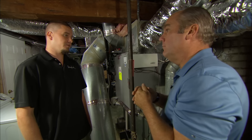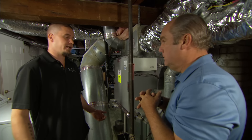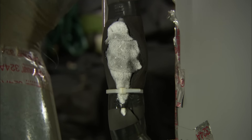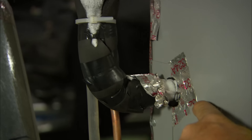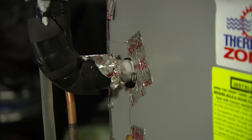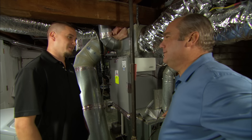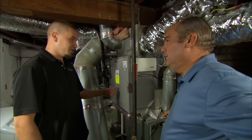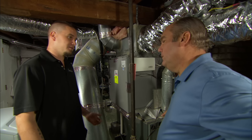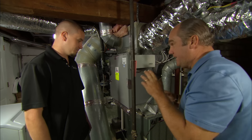What's going on with yours? Well, during the summertime I turn it on and the system runs for about an hour and then it stops working. So I come down here to check it out, and I notice that this is all frozen up. That's actually starting to form ice right now — on the line sets that go outside, and I imagine on the coil too. What do you do? I actually turn on the heat for about five minutes to melt the coil inside, but the problem is I get water all over my basement floor. And then you get another hour of cooling and freeze again?